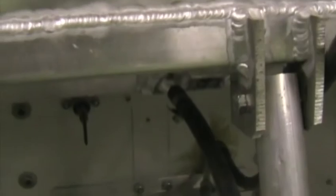There's the breather line exiting the fuselage just ahead of the undercarriage, and it's plumbed to the connection under the tank. That pipe goes to the top of the tank inside, and here's where it exits the bottom of the airplane. It's a 10mm outside diameter aluminium tube. You can see I've cut it to gain a slight positive pressure in the tank.